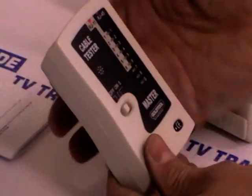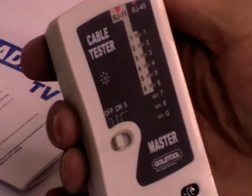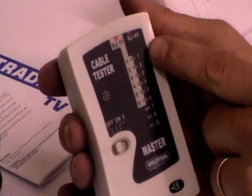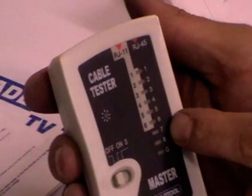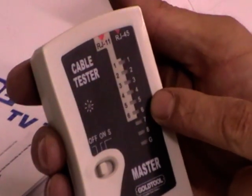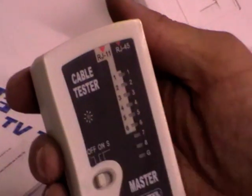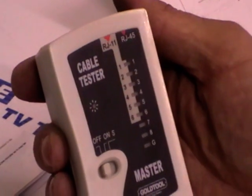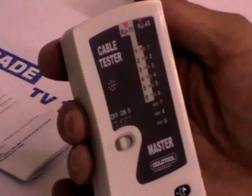So we're just going to hold this in my hand for a moment. Basically with an RJ45 we have 8 pins and there's a total of 8 different lights here — 1, 2, 3, 4, 5, 6, 7, 8 — and then a ground light, and it allows us to test a cable to make sure that it has been wired correctly in terms of each of the pins matching up between two ends, and also that the cable hasn't been damaged in between.